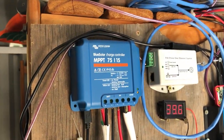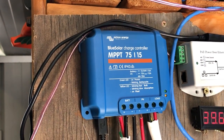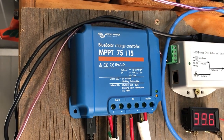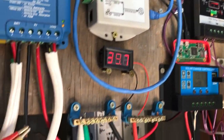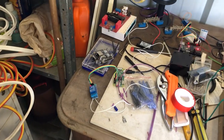The Victron — I definitely recommend it, it's awesome. If you want something cheap, a 20 watt panel and one of these basic controllers works really well for a basic setup — that's what I'd start with if you're just playing around with solar. If you want something more serious, the MPPT charge controller is great. There's now a Smart Solar version with Bluetooth built in, which I'd recommend — only about 120 Australian dollars, so it's well worth it and you can run the app on your phone. My biggest issue is battery capacity — the 45 amp hour is fine for running a couple of Raspberry Pis, some lights, and the watering solenoid which runs about 15 to 20 minutes each day.